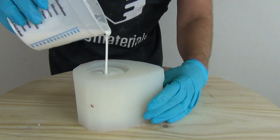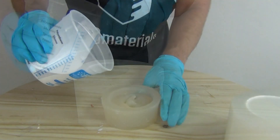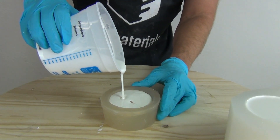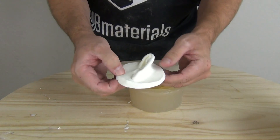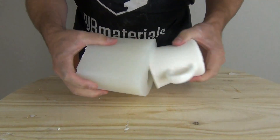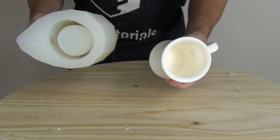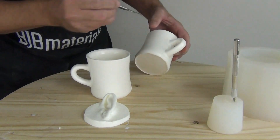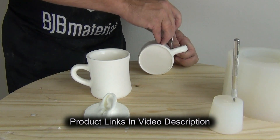Be mindful that wooden stir sticks are a chance to introduce moisture into both resins and polyurethane rubbers. An important note about SC22: it will lower the viscosity a little bit in a lot of these formulas, but it doesn't really change the working time — this will still be a very fast-setting material. To be safe, I let parts sit a little bit longer when plasticized like this, but typically demold time and working time are pretty similar to using the product without the softening agent. I'm going to talk to the BJB chemist to see how far this can be softened for effects like skins.